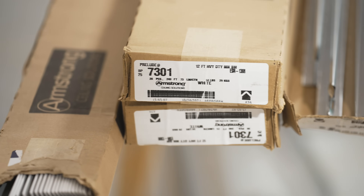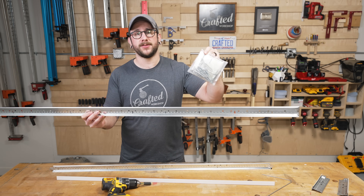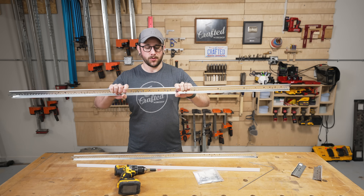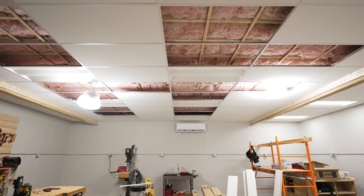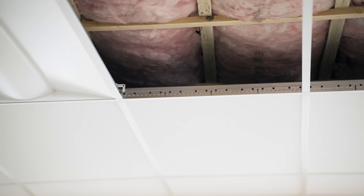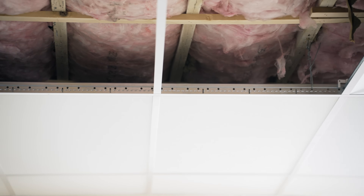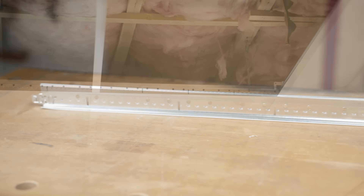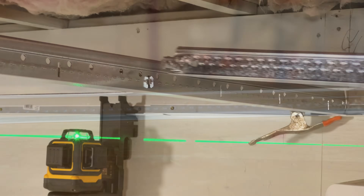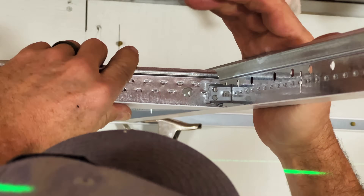The main beams are going to be hooked to the ceiling with hanging wire, and that wire is going to be attached to lag screws. These provide all of the structural support — they're super strong and very beefy — and they run at four-foot on-center increments. You'll click your cross T's into this. The cross T's go between your main beam pieces; the main beam has a whole bunch of little slots and the cross T's snap right into those slots, and that's how the whole system is connected.